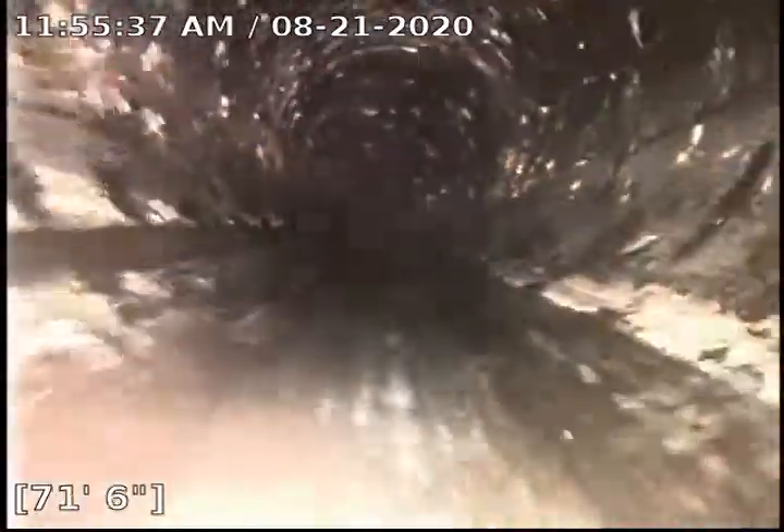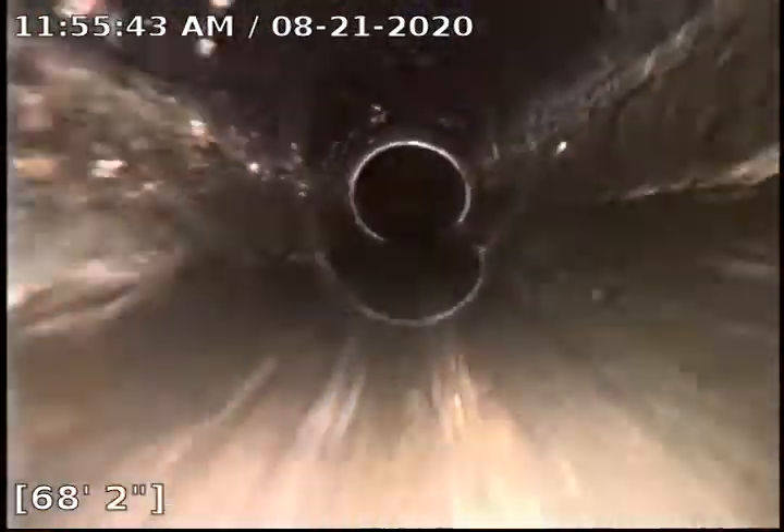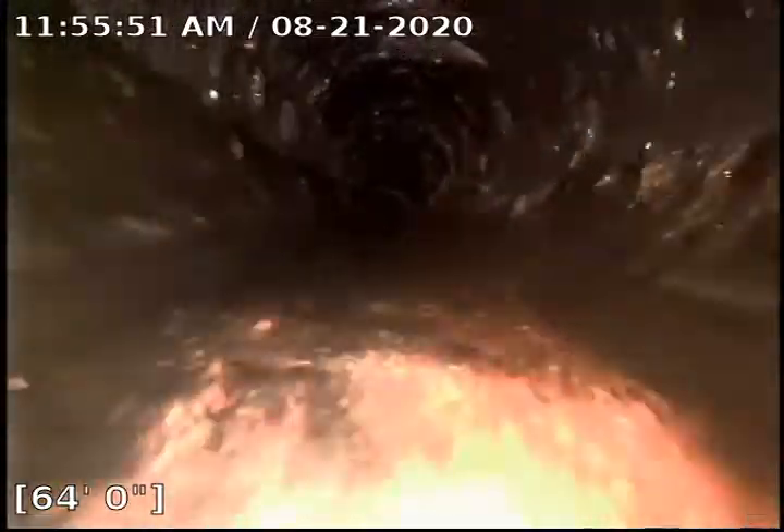So I came here because the kitchen and laundry line was backed up with sludge, grease, grime, muck, and a bunch of lint as well. I ran our K9 sewer machine — that is our chain machine that's made for taking off scale buildup on cast iron and handling sludge. It handles it quite nicely.